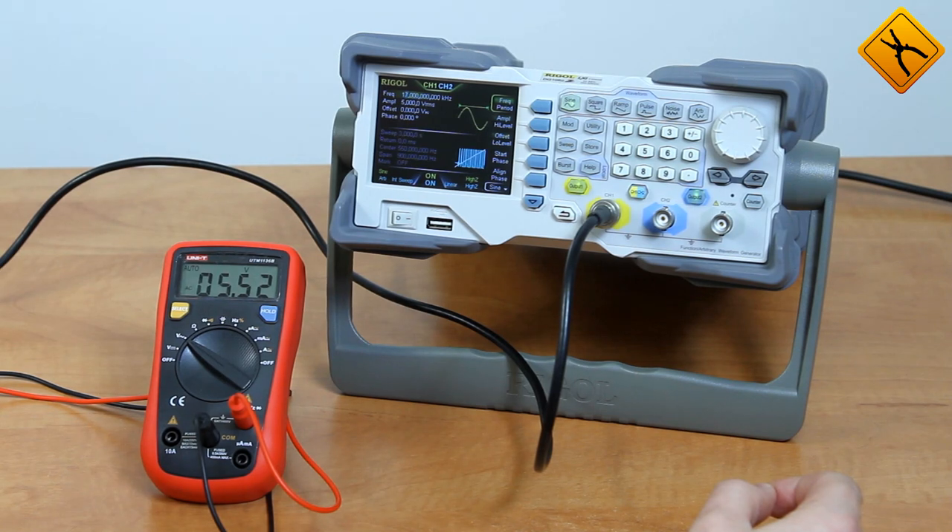Capacitance, frequency, and frequency range when measuring AC voltage — it's amazing. This was a demonstration of the main features of the UNI-T UT136B multimeter. This instrument has surpassed all our expectations and clearly has no competitors in its class. The main advantages are: automatic measuring range selection with manual switching; AC current measurement, while other instruments in its class can only measure DC current; wide capacitive measurement range with a claimed range of 100 microfarad but in fact the meter can measure up to 200 microfarad; and a wide frequency measurement range with a claimed 10 MHz but easily measured up to 38 MHz.